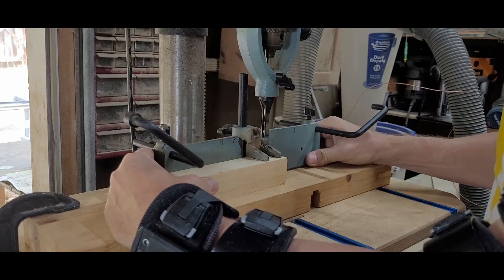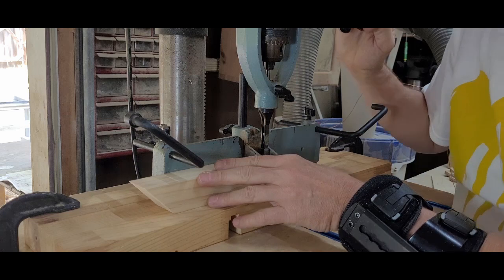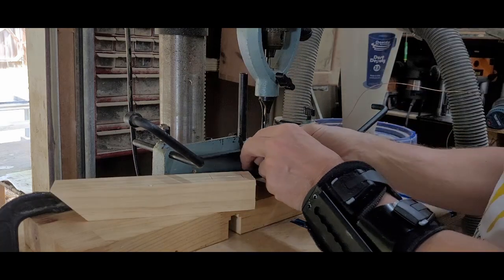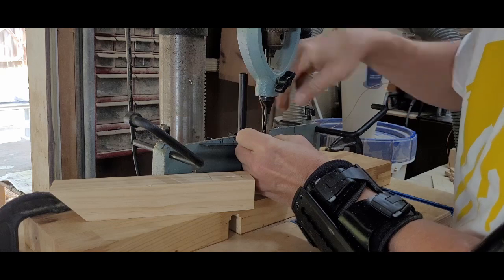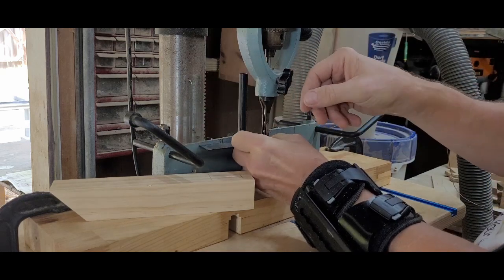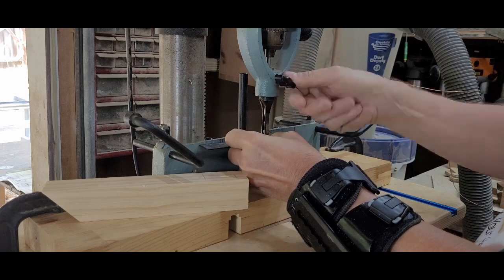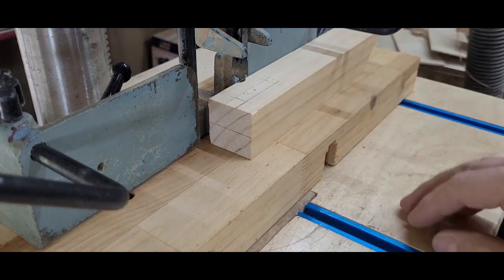The fence can be adjusted as needed until the chisel is on your line. Then I use a small square to ensure that the chisel is square to the fence, and double check my setup. One last check. By extending my layout lines to the end of the stock, I can lower the chisel and verify that the fence is in just the right location.